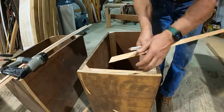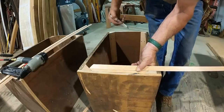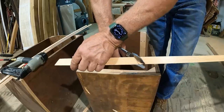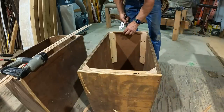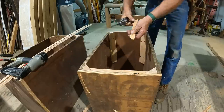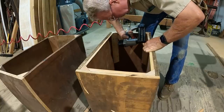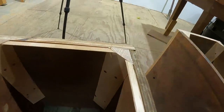I'll do it again a little further from the end because it can blow up if you're too close to the end of the piece. If it pushes itself away, just keep it parallel to the fence as it goes. I take this length off the other piece, angle it the other way — came out a little bit long. Shave it. It's not fine woodwork, but it's pretty good formwork.